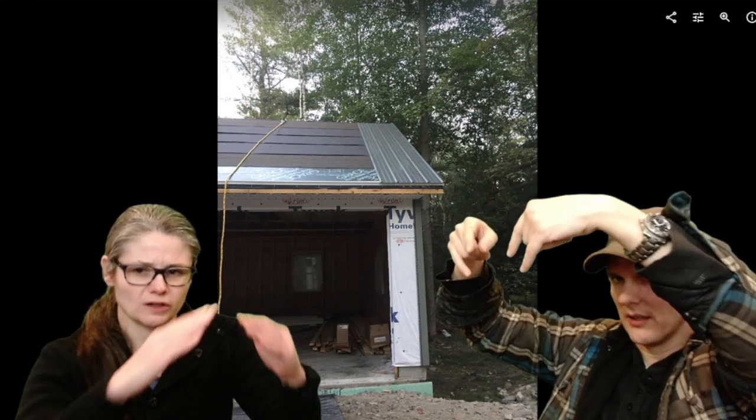So you can see that fall thing here, and up at the top... I think I got this on Amazon. It's actually a pretty slick setup. It's just a metal bar, or metal plate, with holes in it, and on the end it has 2 D-rings. This thing goes right over the ridge, and you nail it in on this side, like a 90 degree angle, and then the D-rings go on the end. You just clip your fall restraint on there, and we actually built it right into the building. So these little D-rings are sitting up there. You can't even see them. They're tiny.